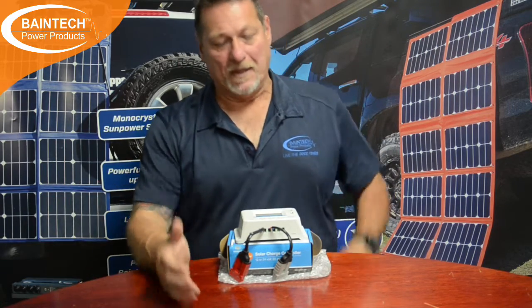Like solar systems at home — if you've got a 5 kilowatt system on your home, they'll generally put 6.5 kilowatts of solar panels up there to try and maximize in low-light conditions as well. But you will never get more than your 5 kilowatts.